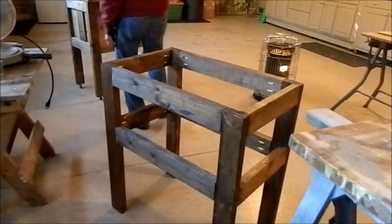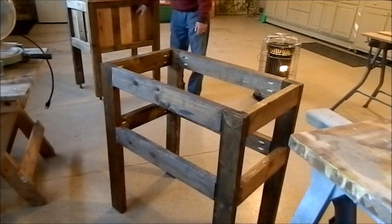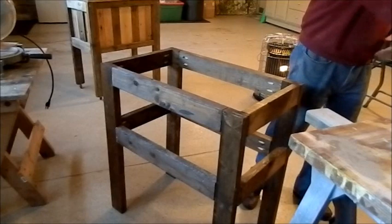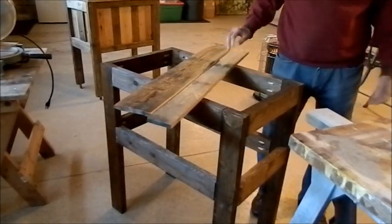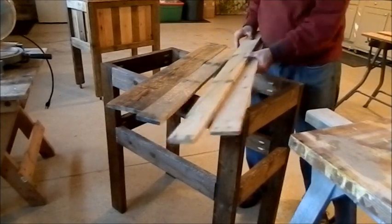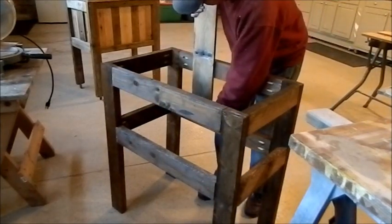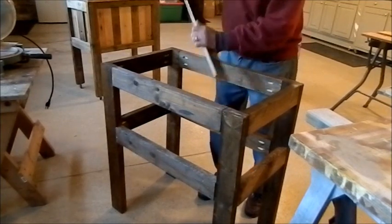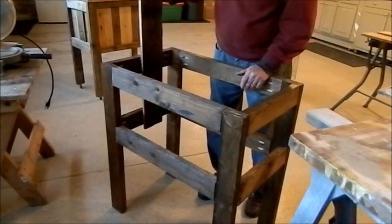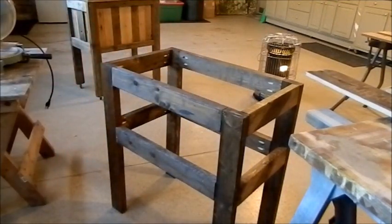What we've got to do is start on the pallet pieces. These pallets come in many sizes. I've done a little bit of cleaning on some — I'm trying to get a little bit of a pattern going. I've taken several pallets apart. You get some big pieces, some narrow ones, some a little bit clean. Now what I've got to do is figure out my design. I'm going to be putting them in from the inside and cutting them all to about 12 inches. These pallets are about 40 inches, so I'll get three pieces per board. Let's see how artsy I am.